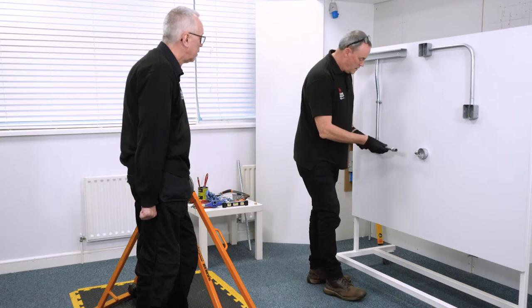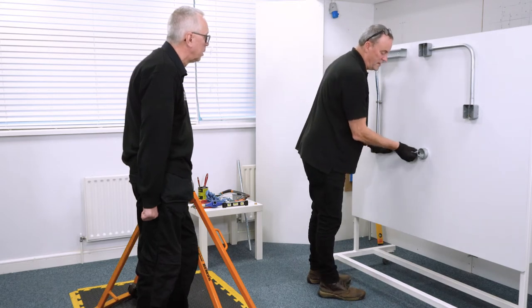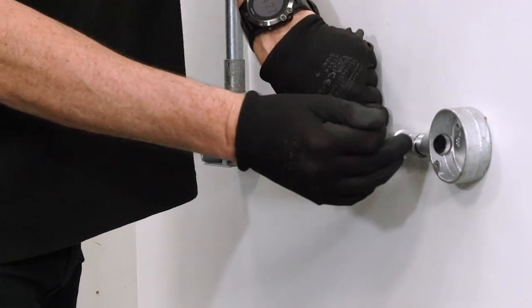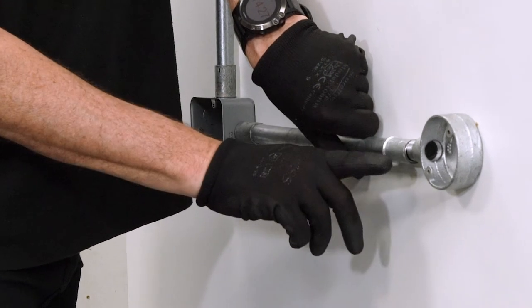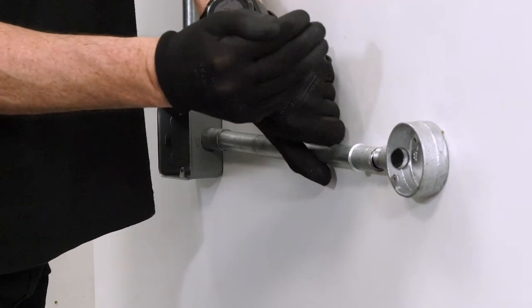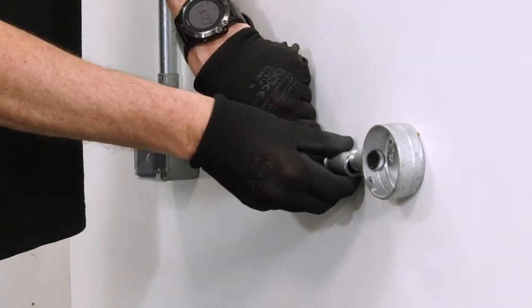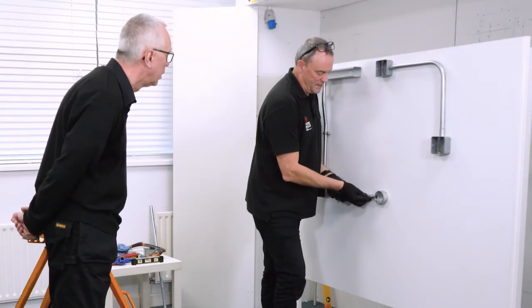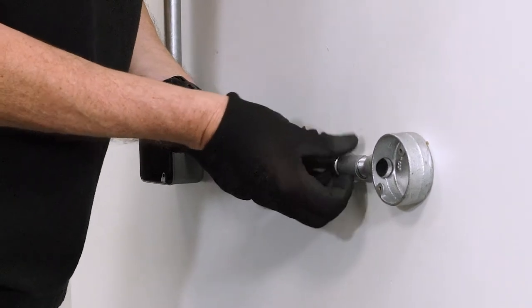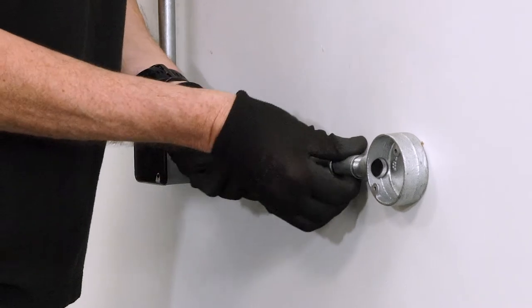What we do now — offer this up and it will just slide in place, between the nipple and the accessory point that you want to fix it to. If you find it's slightly too long, just wind the nipple in — you've got that tolerance on it. Or if it's too big a gap, just wind it back. That's why we make it the length we do — it offers a bit of tolerance. We now offer this up so the nipple is in alignment with the tube. This is why it's called a running coupling — because we now run the actual coupling up onto the nipple.